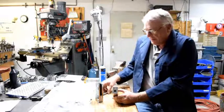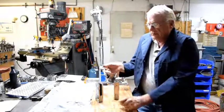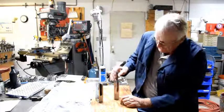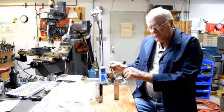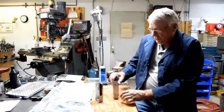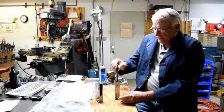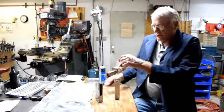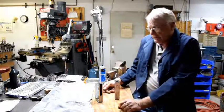Our next step was to come in with a reduced cut carbide end mill. This is solid carbide, 4 inches in length, and the reason for that is that we needed to get down here to enlarge this hole to the proper size. We have a hole all the way through, set up in the vise on a set of parallels, so that as it came through on a spiral motion, you could cut the chip. The coolant coming at this angle would hopefully flush all that out and we'd have a clean cut.